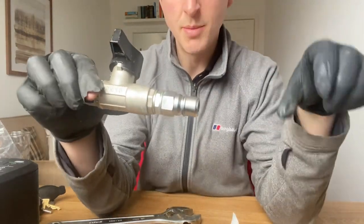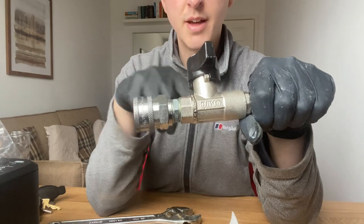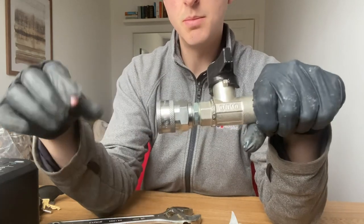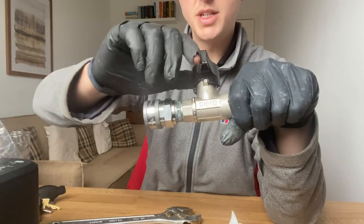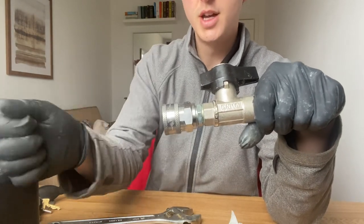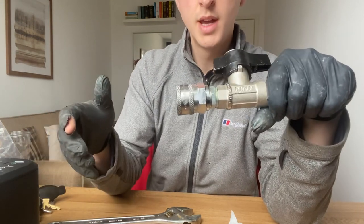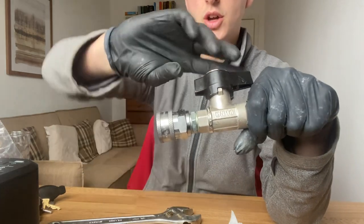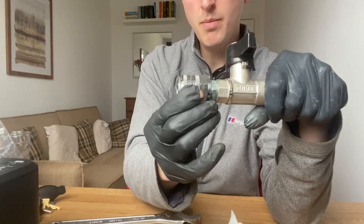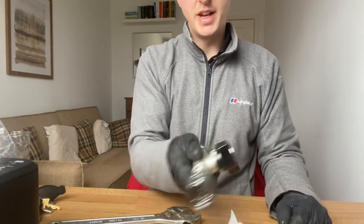And that's it assembled. Imagine you've got your high pressure hose plugged in here with your ball valve. If you've got a lance with one of these fittings at the end, you simply plug it in, then when you're ready to go, open up the ball valve. You've got your high pressure — you can start pressure washing with your surface cleaner or turbo nozzle. When you've cleaned a certain area, just turn the valve, release the pressure in the gun or surface cleaner, and unplug it.